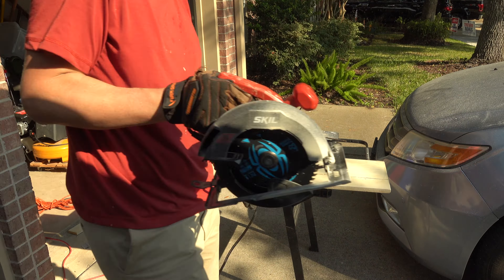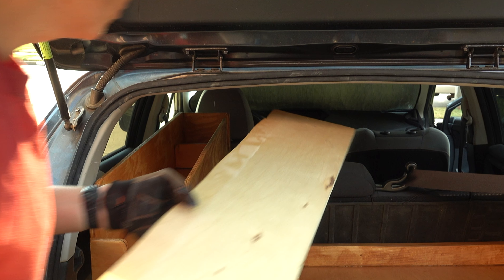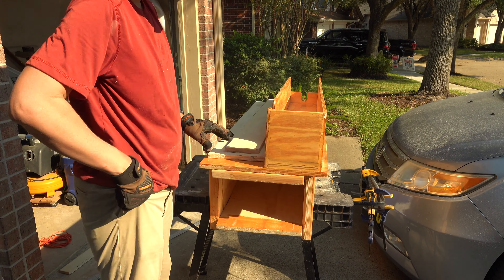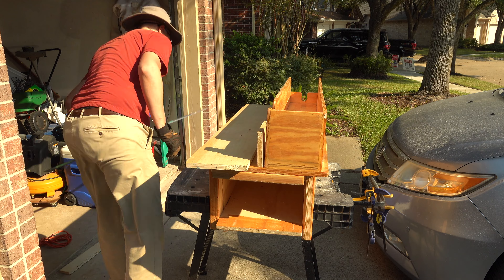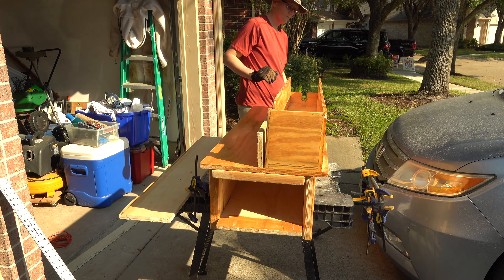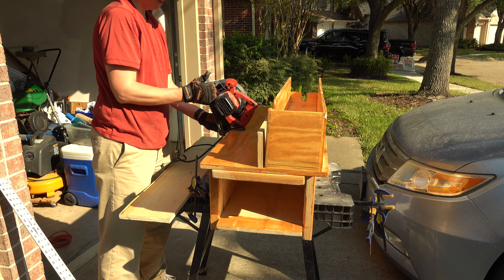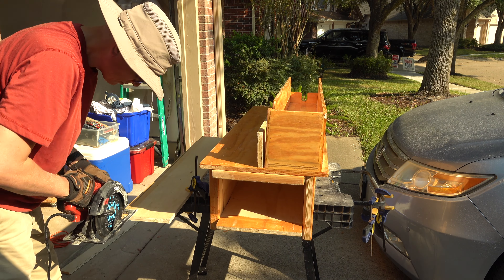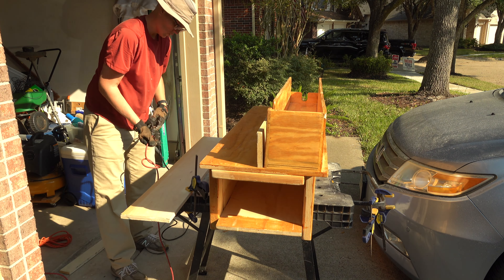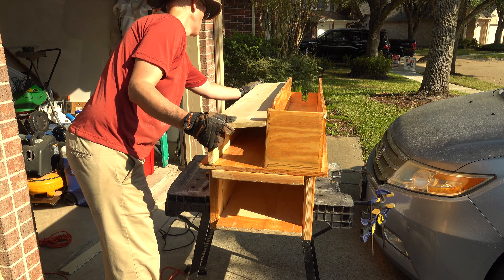It might be this one because I'm stopping and starting — I think the blade's getting a little dull — but on one of these things, right here, look at that cut. Look how horrible that is. It's like a wavy noodle. It must have just happened on the cut I was talking about, and in fact it was. I'm gonna get the straight edge out, which is another thing I never had — these straight edges. I really recommend it; it's like 48 inches long, great for getting a nice long cut. You can use chalk lines but even those I could mess up. Here I did use the straight edge, I did firmly press on the circular saw, and I made a really clean cut — so I made up for my awful error. We'll just learn from it.